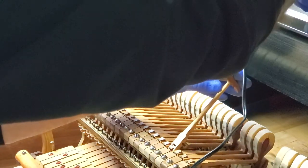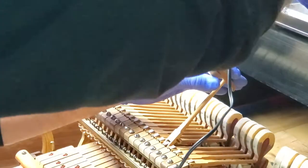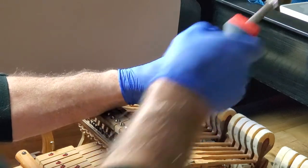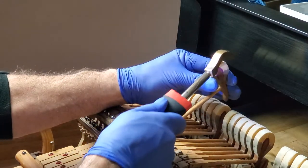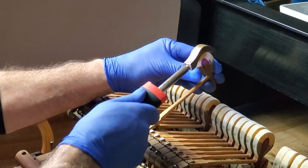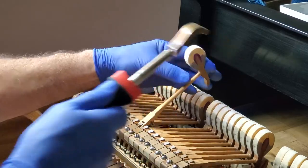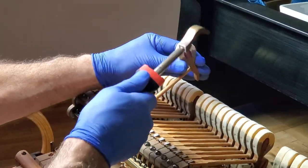Three or four of these I had to re-glue. If they're loose they must be re-glued, and you should use what's called hide glue, which is heated up in a pot. You can buy it from Howard Piano Industries — it comes in flakes, it's water soluble. Put it in a little crock-pot; it takes about a day to make.